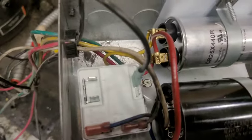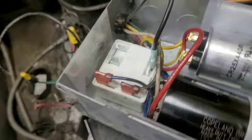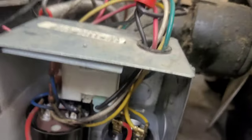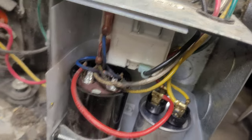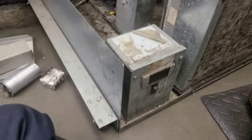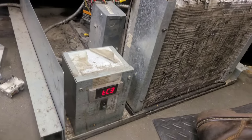That's how my connections are going to look — an electrical box. And that is my new connection. So this is now what is feeding my power from the black wire, from power to the load — it's through that wire nut instead of that weak spade connection. Now that I have reconnected power, y'all get to join me while I flip on the switch and see what happens.